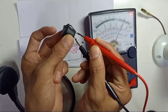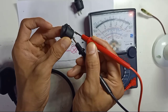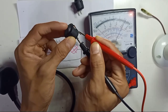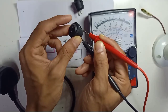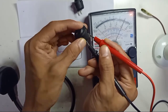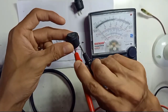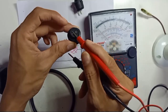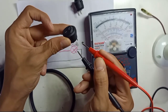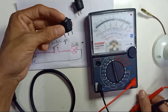The difference between this three-pin and the two-pin is: in the middle is common. If you clip to the other pin, you'll see the contact. Before you press this side, this side is going to be off and the other side is going to be on. When you press this side, this side is off and the other side is on. But when you press the other side, this side is on and this side is off. So this is just for a two-way switch.